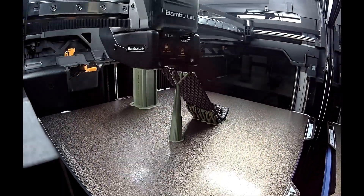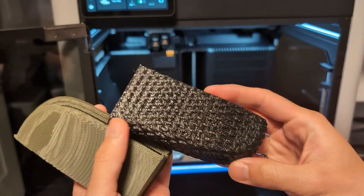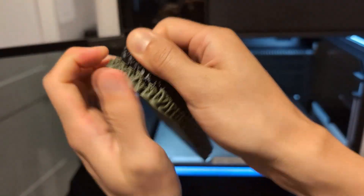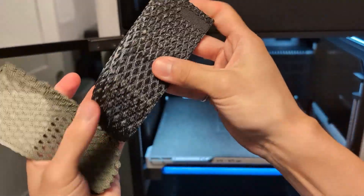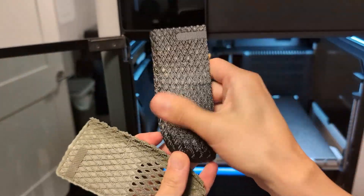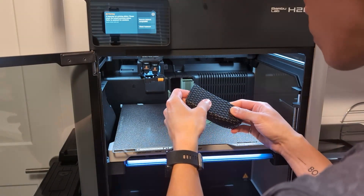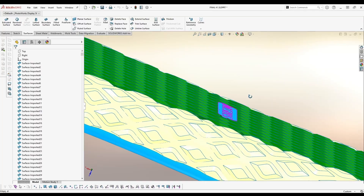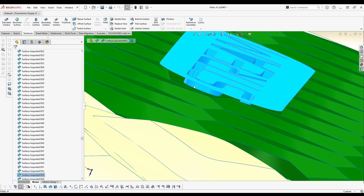It wasn't immediately obvious what orientation would be best, so I ended up just testing them all. Because this is a shoe prototype, I wanted the outer features to come out as clean as possible. Most of the prints turned out pretty well, but the flat ones weren't that great. The shallow curves caused some visible layer stepping on the inside and the outside, and even though zero support gap usually leads to good results, the areas where supports touched still looked a little rough. The angled print ended up looking the best overall, but strangely failed partway through. I took a closer look at the model to figure out why, and it was immediately clear — there were some strange surface artifacts that lined up exactly with the layer height where the failure happened.